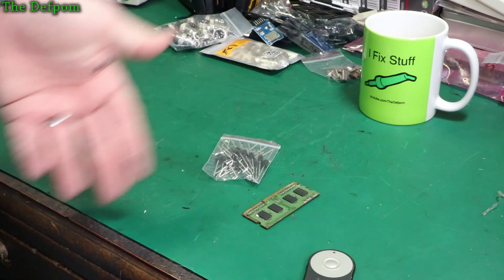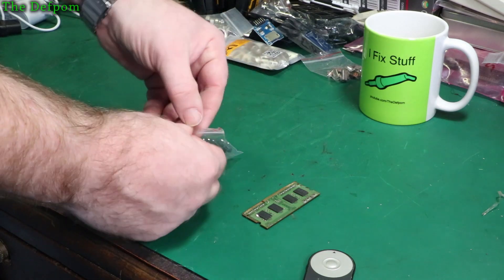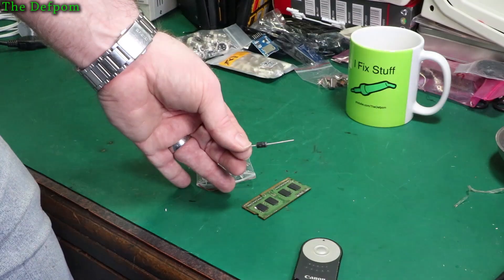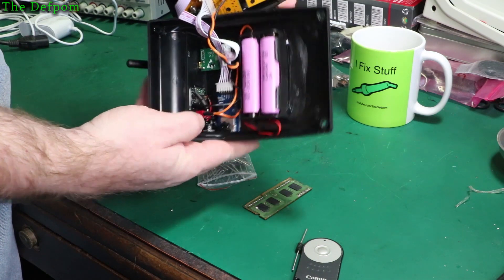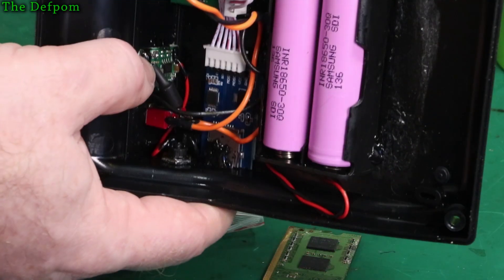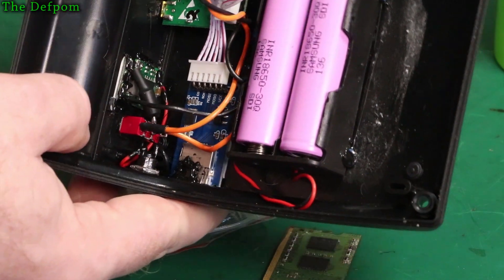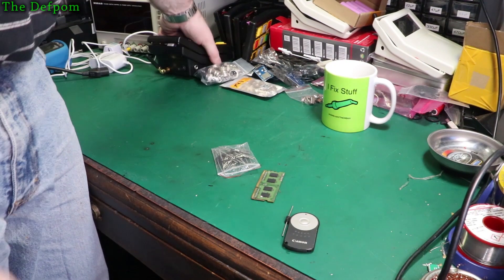Thanks to my Patreons as well — helping to buy things, get things together, tinker with little projects, and come up with ideas, as well as financing my mailbag. These are some Schottky diodes — SR5100, rated at 5 amps. I use them on my DC input: the DC input goes to a buck converter, which then goes through this Schottky diode to prevent back-feed from the battery charging circuitry so the batteries aren't discharging into the buck regulator. I'm using Schottky because it has lower power losses, less heat generated — just better than using silicon generally.